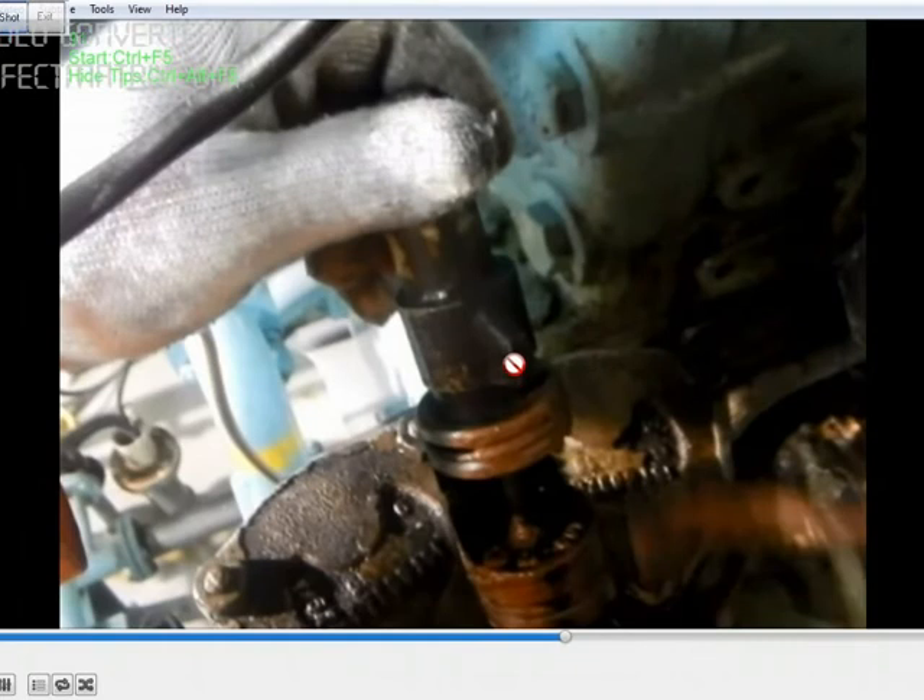When the indicator is kept in the center, both filters will be used. When you move it to this side, then this filter will be used. This is the main thing to check — whichever side the indicator is on, that filter will be used. You can see this slot will move when the indicator moves to one side, covering the hole. When you move the other side, it will cover that side, so the fuel coming in will go to that filter and not to the other filter.